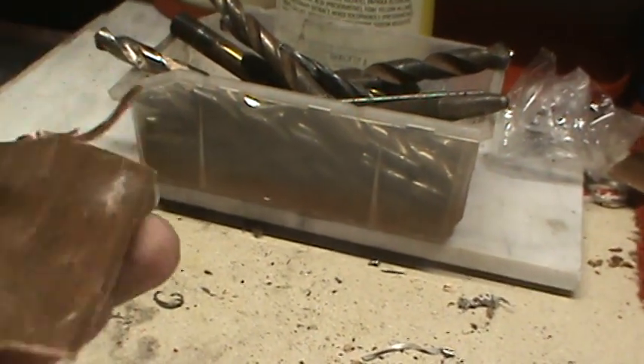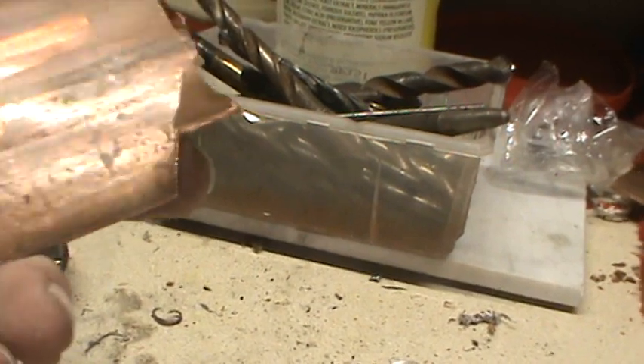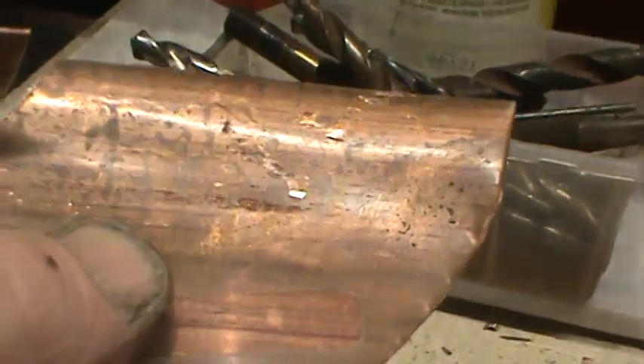The same process I did before — you put it in the wood, you pry it out, beat on it with a hammer, and this is what you get. I haven't put it in the English wheel yet, but what I notice is copper from Lowe's sucks — copper from Menards is more expensive but it's better. See the machine marks, the pits right there? When I went to Menards because Lowe's doesn't carry two inch stock — that's the biggest they have on hand. This is all beat up in here because I'm prying on it, but you don't see those machine marks.